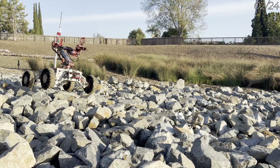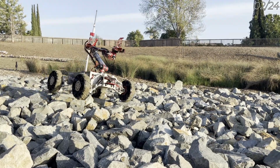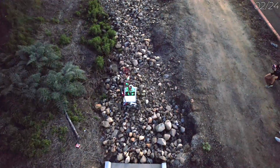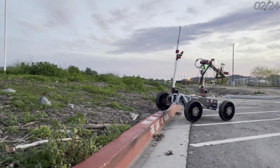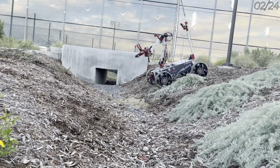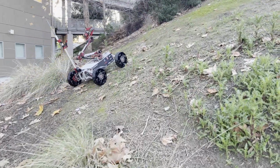The drive system is built around a custom control arm suspension with adjustable pneumatic shocks, providing resilience during missions across rough terrain. Ares' 14-inch 3D printed wheels, paired with custom wheel hubs and bearing blocks, balance durability and flexibility while maintaining a low weight.